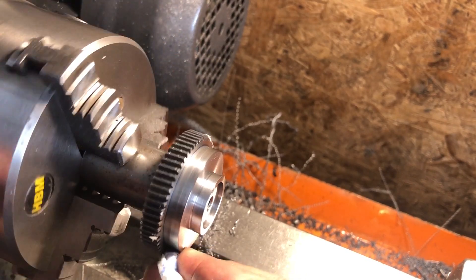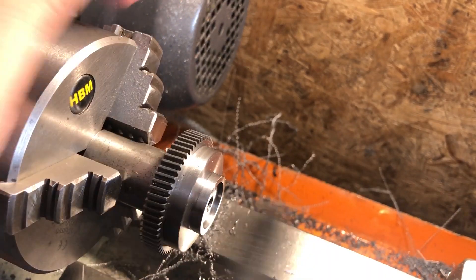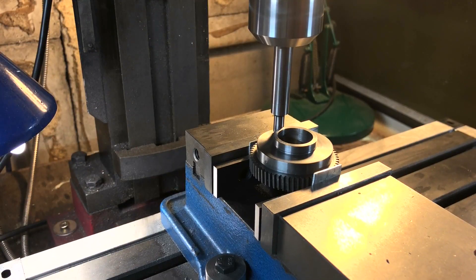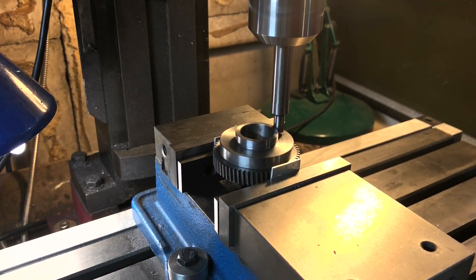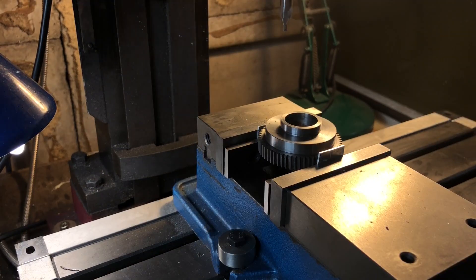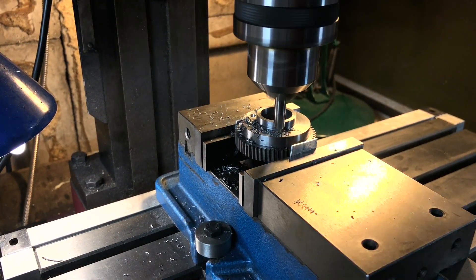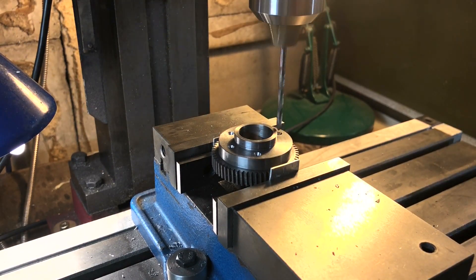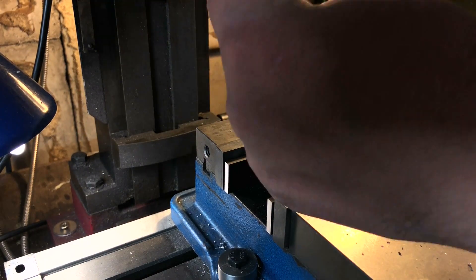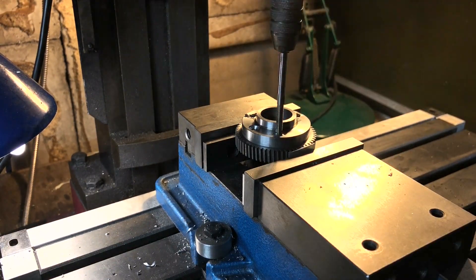I machine that final chamfer with the bolt removed — not a recommended process, as if the work were to spin it would ruin the bore and probably scrap the part. The last features are a few bolt holes, so it's over to the mill. I have this up on parallels with thin sheets of aluminium to protect the gear teeth. Rather than making a jig as the plans suggest, I'm using the bolt hole function on the mill. After centrefinding and checking with an indicator, it's a simple task of stepping through locations using the DRO. There are three equally spaced holes to mount the plates and one odd hole to mount the whole assembly to the worm bracket — all on the same PCD. I've set the DRO for a six-hole pattern and am machining holes one, three, four, and five. The three mounting holes are blind, drilled tapping size for M4, while the odd one is drilled clearance and countersunk. Finally the three holes are tapped and we can take it over to the bench.